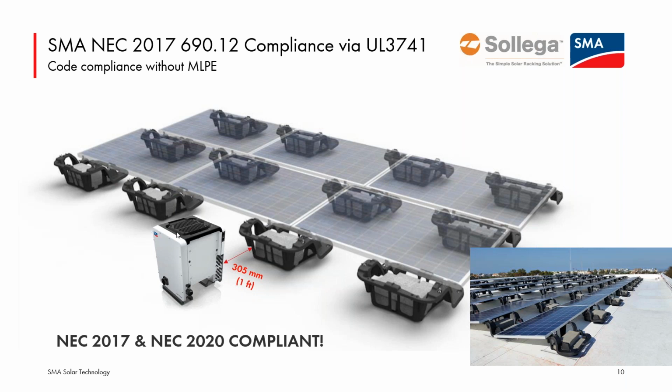So the Core 1 has been certified with the Solega Fast Rack 510 and the Iron Ridge BX system. It's this ballast type system you see here. As long as that is installed per the manufacturer's requirements and all of the DC conductors finish within 1 foot of the array perimeter, which includes all these ballast tubs, the UL 3741 listing allows for full compliance with the NEC requirements for rapid shutdown without requiring those module level devices.